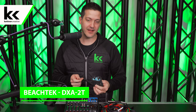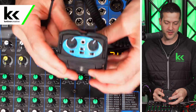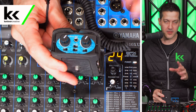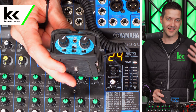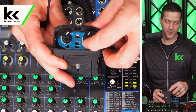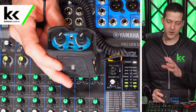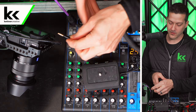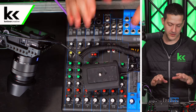The first option to connect this audio mixer to your video camera is to use a small audio interface like this one that is built exactly for this purpose. We can see it has two XLR inputs and on the side a whole variety of controls. The big thing to note is that the output of this audio mixer is going to be coming at line level. On the inputs of this small audio interface you can tell it that you're sending a line level signal and it will automatically gain stage everything appropriately for your camera.